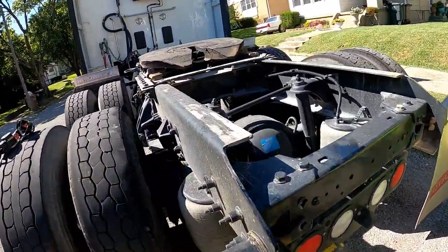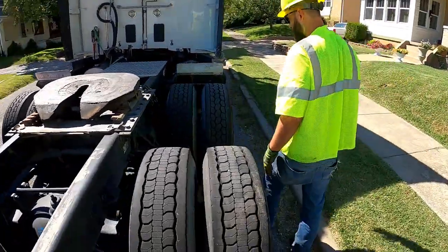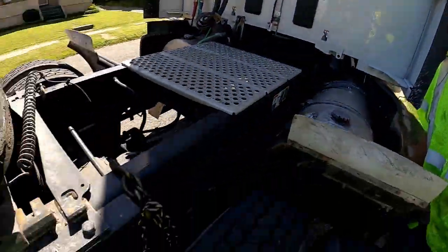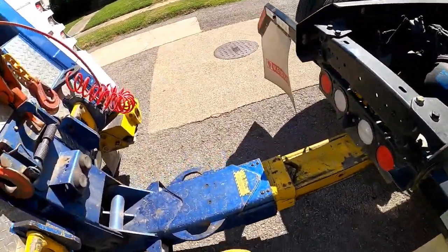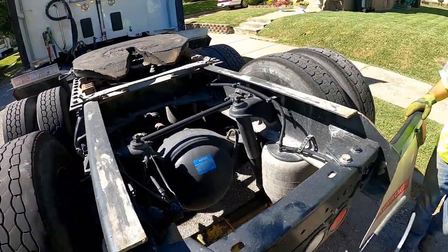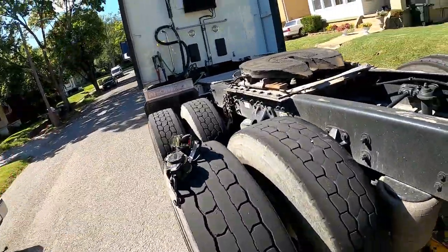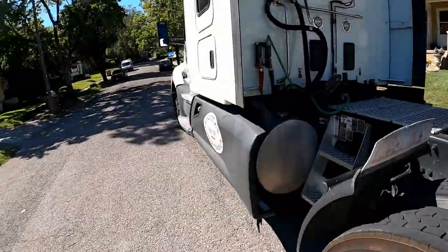Now watch what happens whenever we lift. Since we lift this, it will tighten the chains on the front axle, and then it doesn't overextend the airbags. That's exactly what those are for. All right, now we need safety chains. There's two single hook 3/8 chains that we use to tie the axles with. Grab those and I'll work on the steering wheel while you're doing that.